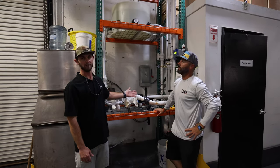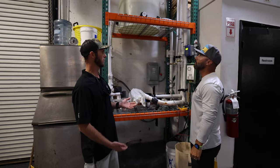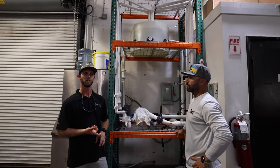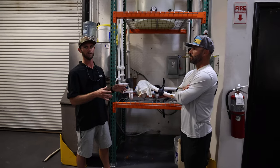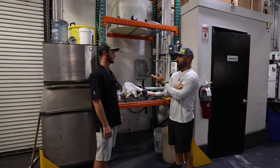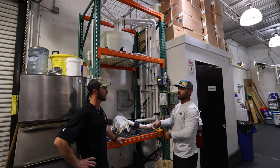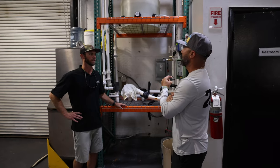This is the engineering corner — this is where the engineer actually tests all the pump curves. A lot of manufacturers need to know the numbers for pumps in terms of head pressure. This is showing six feet of head pressure. We can take your 2,500, 4,500, or 7,500 gallon per hour pump and get the manufacturer a guaranteed gallon per hour rating — whether it's a three-foot run, six-foot head pressure, or even eight-foot head pressure. These systems, the bilge pumps and sea chests, are in the bilge below the waterline, while your live well is above deck — so knowing exactly how many gallons per hour you're getting to the actual well is extremely useful.